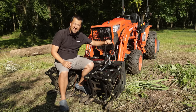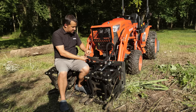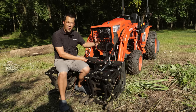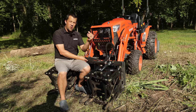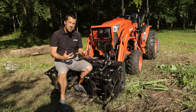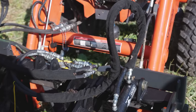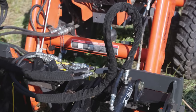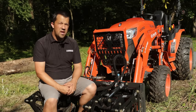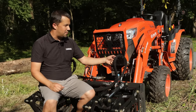I've noticed on the hydraulic hoses out here on my grapple that I'm starting to see a little bit of weathering. On the ones that aren't covered with wear sheaths, you can see places where the hose is starting to dry out, and the UV from the sun is starting to make the labels wear off — and over time that kind of wear is going to continue. I would say if you can find places to cover those hoses with fabric sheaths, you're doing yourself a favor. Protection from sun and UV can be so destructive and break down these rubbers — you're going to make your hose last a lot longer by protecting it with something as simple as a little bit of fabric.